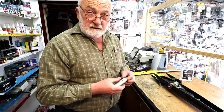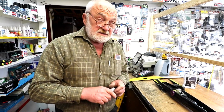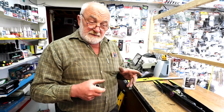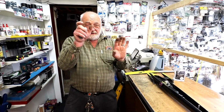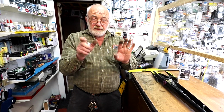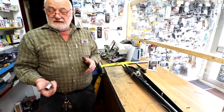Does that work in the air as well on the planes? That the more cooling around, the better combustion you get, or is that a bit different? On the West motors, on the T motors, which are designed for prop hanging, you get a backplate cooler, because again, if you can keep the crankcase cold, the volumetric efficiency goes up. Plus, if you're prop hanging, it's only the last 25% of the prop that gives you something like 70% of the performance. So that's going to be outside the diameter of the engine. So by keeping it cold in the centre, it works better.